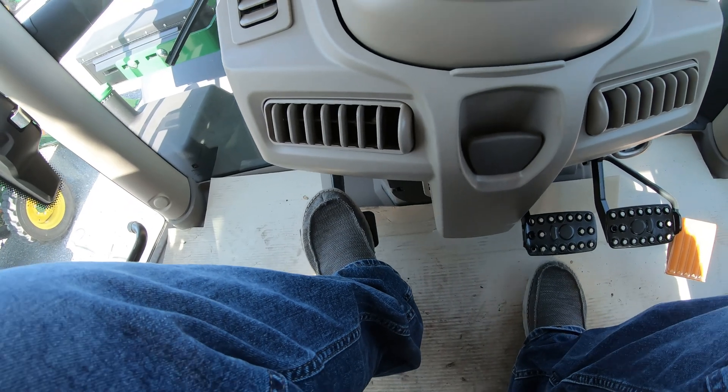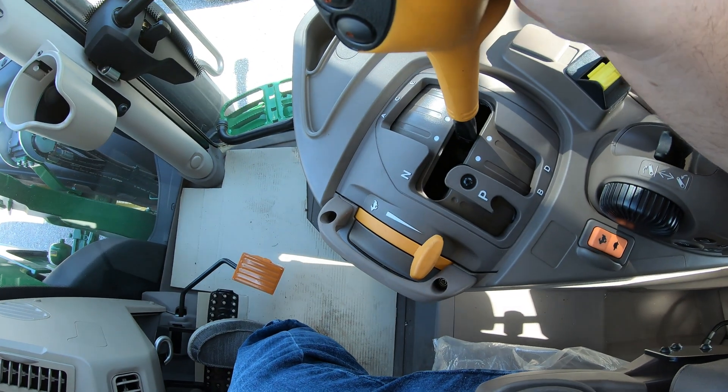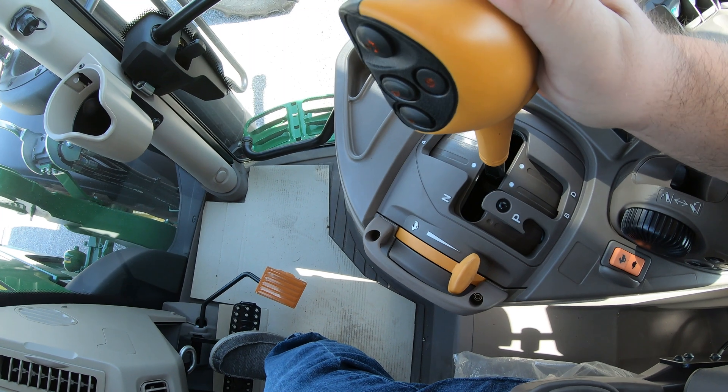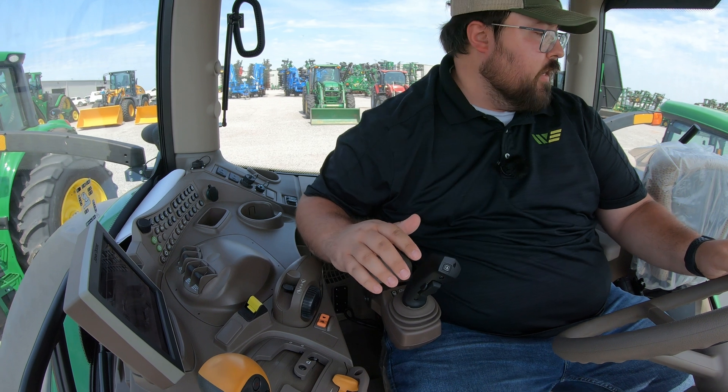The next goal is to show you how to drive one of these machines using this declutch button. When I'm first starting out, I am going to have my foot on the clutch and on the brake to initially take this machine out of park. So we are going to get it into neutral, and once we have it there, we are in complete neutral. I'm going to go ahead and put this over here into our A gear — go into A — and then I am already in number one gear. I have my foot on the clutch and we're starting to roll, so I am just going to slowly let off of my foot clutch and put us into forward. And we are just going to start to creep slowly forward here in A1.